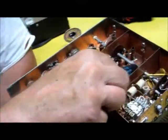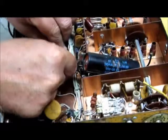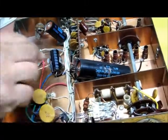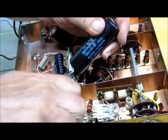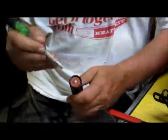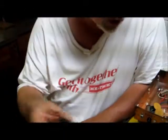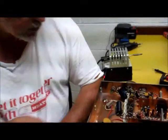I also have another capacitor that's going to get replaced. I'm going to take this other end of this capacitor — it's much smaller than the original but that's okay — and lay it across and put it in the holder. Now I want to show everybody why I'm replacing this one: as you can see, it has blistered out. That blistering means the electrolyte, the oil inside the capacitor, has basically leaked out, hardened, and this thing is garbage — no good.